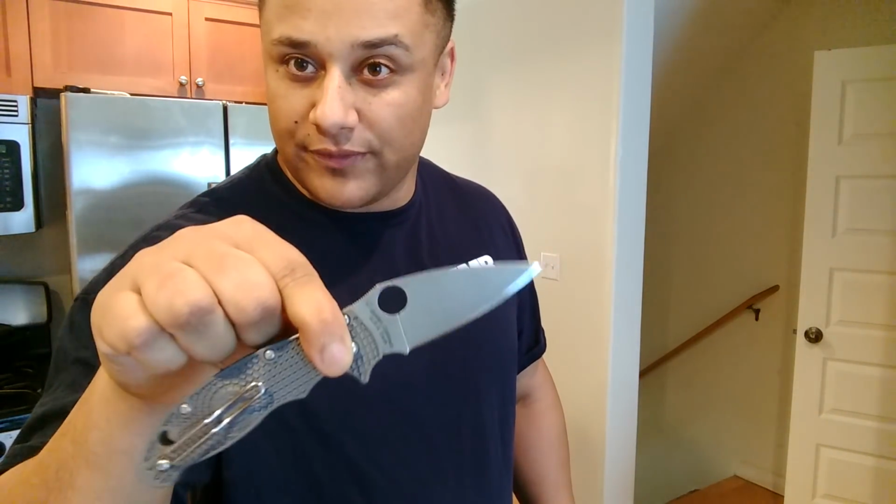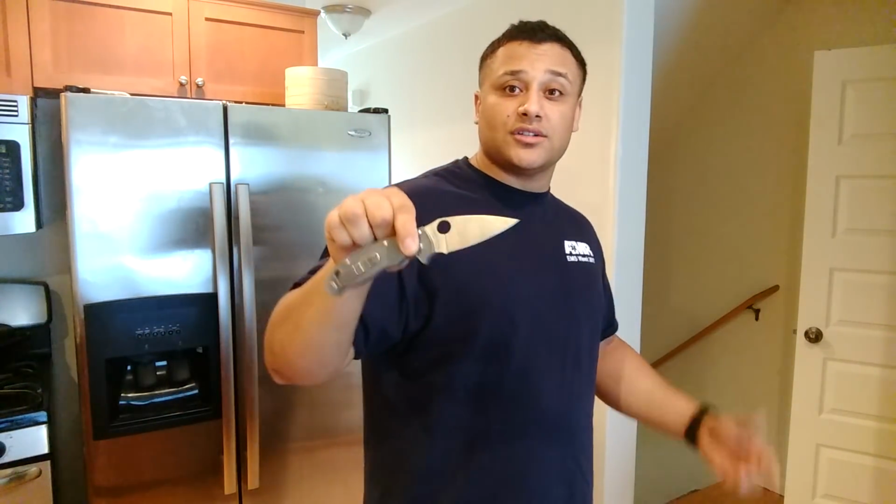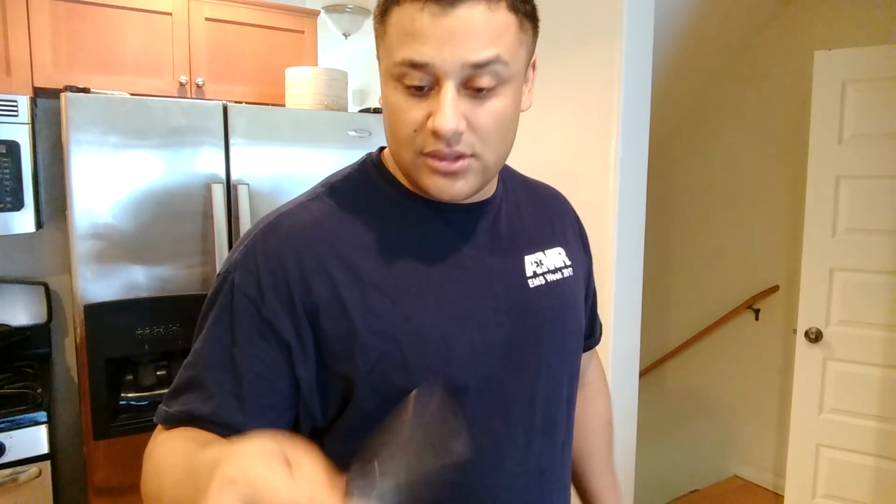It's 67 HRC on this guy. Okay, there's actually a video that somebody put up on the Facebook groups where they actually Rockwell hardness tested this guy. 67 HRC. We've got 10% tungsten. We've also got 6% on the, what am I saying? Vanadium. There we go. So, yeah, it's hard stuff. It is what it is. But for what it is, it's actually not brittle. Okay, it's not brittle for what it is.